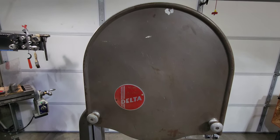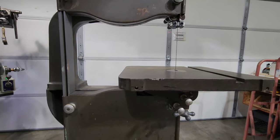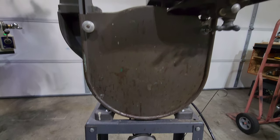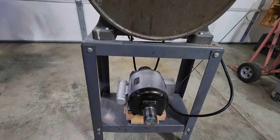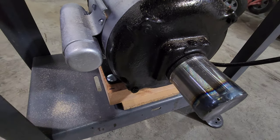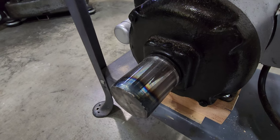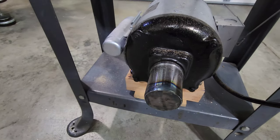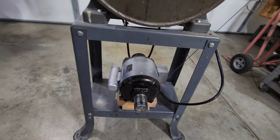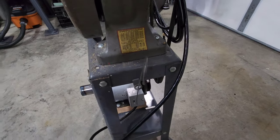We are done with the tune-up and repower of this machine. One thing I wasn't able to capture on camera: I made a guard for the motor shaft that sticks out on the side where you'd be working when operating this machine. It's just a piece of tubing that I used a boring bar on a lathe to bore it out until it made a nice snug fit over the end of the motor, and I welded a cap on it. You don't want loose clothing near spinning machinery.